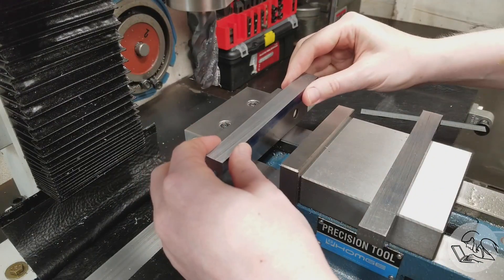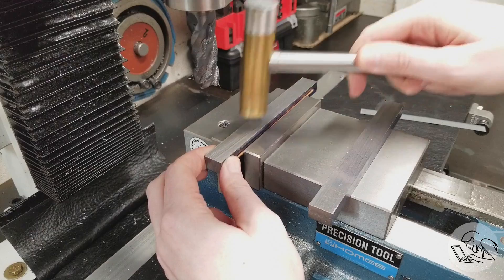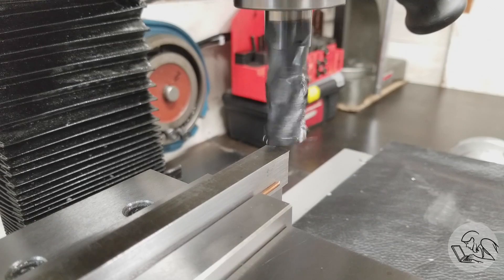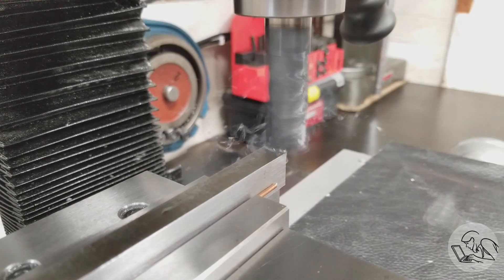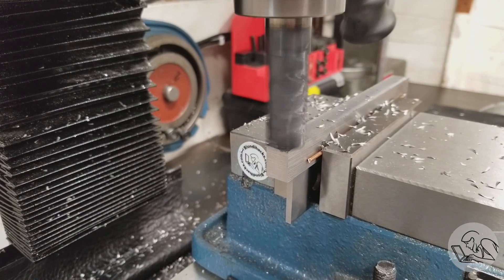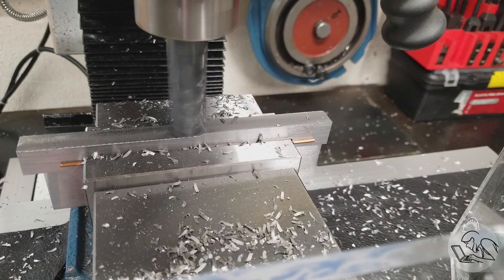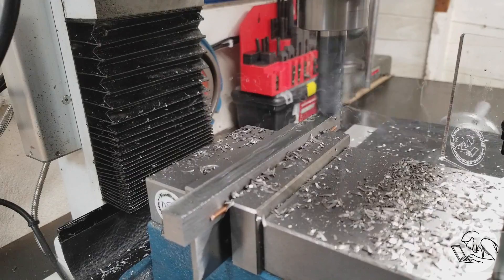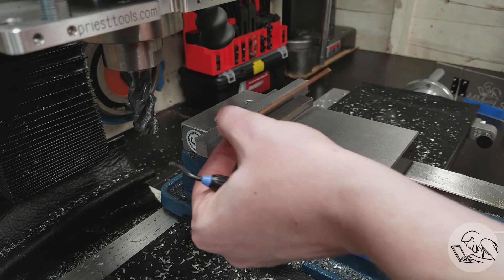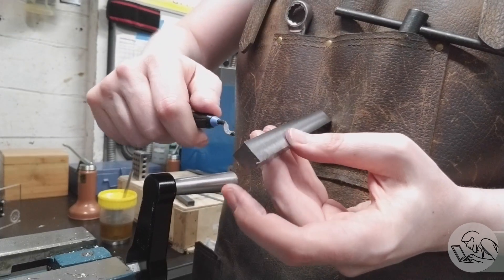I need four identical blanks for the four jaws, so I'm going to set this up and square up the stock. I'm using a copper wire on the movable jaw instead of my usual piece of round bar — someone suggested this and I wanted to give it a shot. Actually, I like it; I might start using this as my go-to for canceling out the influence of the movable jaw against an unmachined surface. This is the standard method I use for squaring up stock: machine one side, put that side against the fixed jaw, and rotate it around.